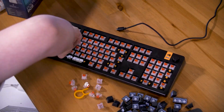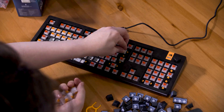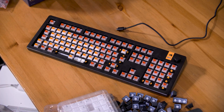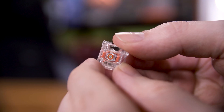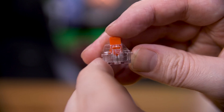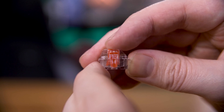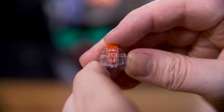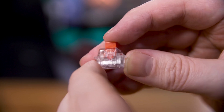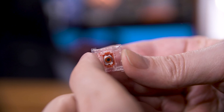The other benefit to just needing a tiny sensor on the PCB itself, rather than a pinned connection, is that these switches are completely separate from the PCB — they don't even have pins and sockets. They are completely free-floating, which means you can much more easily make them hot-swappable. And because the switch is actually just a magnet embedded in the stem itself — just the stem, the case, and a spring — there's basically nothing to wear out and fail. Mechanical switches have a springy bit of metal that wears out over time, eventually failing, and if it gets dirty it can be buggy. These magnetic switches have no contact parts and no switch mechanism to fail, so should be considerably more reliable.